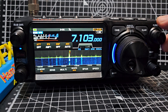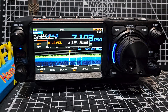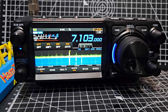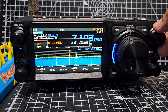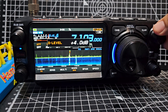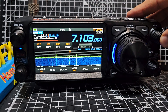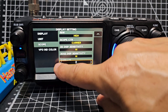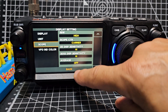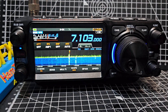So what I'm going to do is turn the D level back up. You've got quite a strong signal — see the way that looks. I'll turn it down, bring it back. This is sort of how we like it — quite a dark blue. Then go back, hold down function and display. We're going to go to averaging and turn it off, then we'll try the eight afterwards. Averaging is now off.